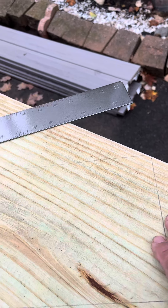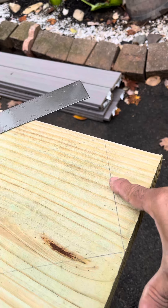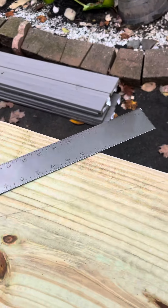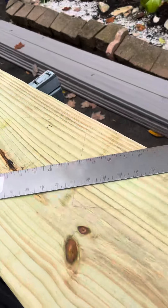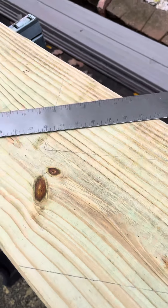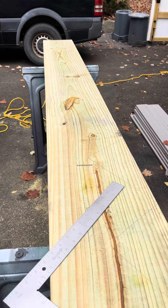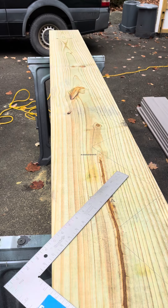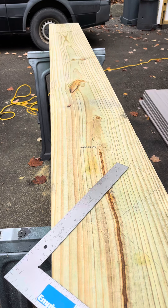You've got to give yourself enough allowance. Because if I went the way it shows on certain videos — starting from the corner — I wouldn't have enough lumber here. When I did it from the corner, I only got eight risers instead of nine. So I had to play with it, move it, and shift it to get it to work. Just a little caution: before you start cutting your stringers, make sure all the risers fit on the lumber you have. Get a little bit longer, play it safe, and you should be okay.